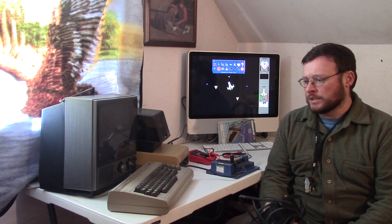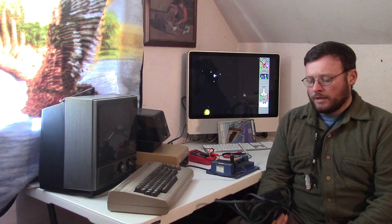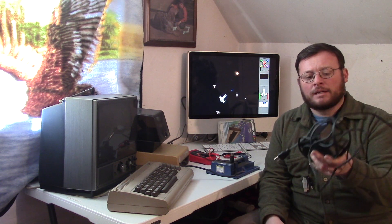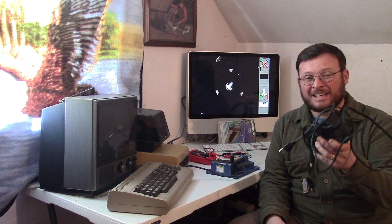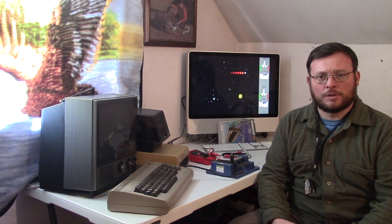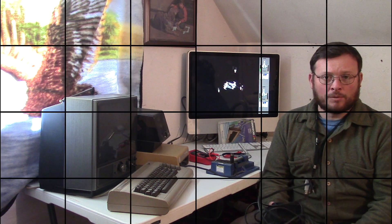I'm going to be going through that machine and I'll share some videos with you as I go through. If you're interested in that stuff, make sure you subscribe and check out some of the other videos I have in my machine shop. But before we can really use this Commodore, there's something you need to check if you pick up one of these old computers — and that is the power supply. The power supplies on these older Commodores, and really any older electronics, should be suspect because as they age and begin to fail, they don't put out the correct voltage and can damage your computer. This could also apply to older CNC machines, NC tape machines, or anything else you might use in a machine shop or at home.